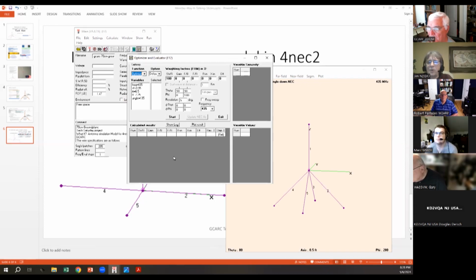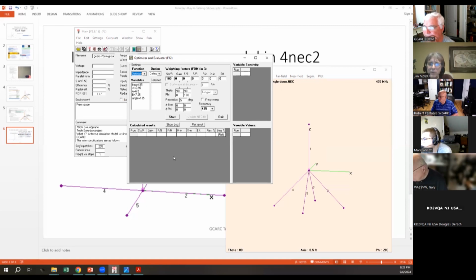I mean, you can do a whole bunch of hand edits. Just think of like we were on Saturday, bending the top of this antenna down a little bit at a time to try and find the right thing. We bend it twice and measure, and then we try and do some math and all this. My goal here is, what do I want to optimize? The gain, the front back ratio, if I had a beam antenna or something like this? No, I want to 100% optimize the SWR. Okay. How am I going to do that?